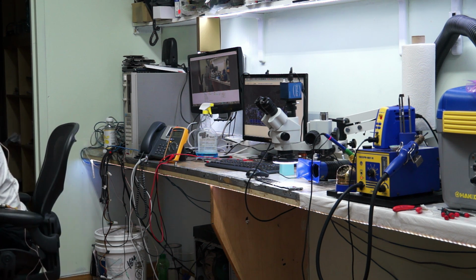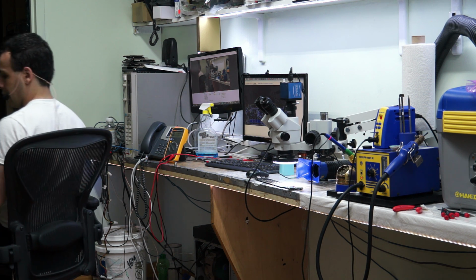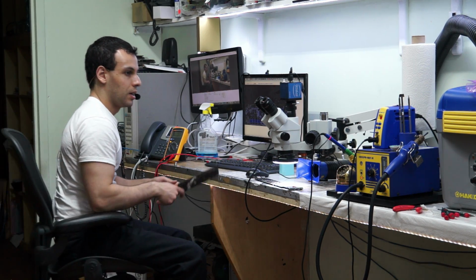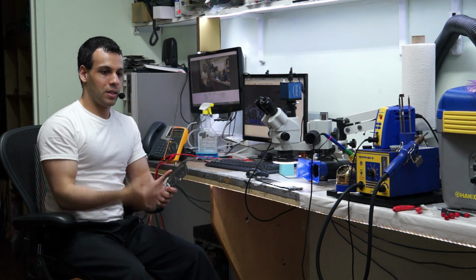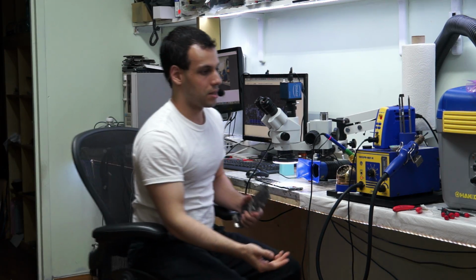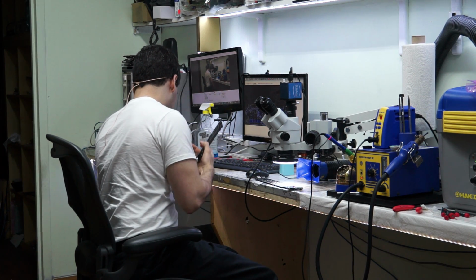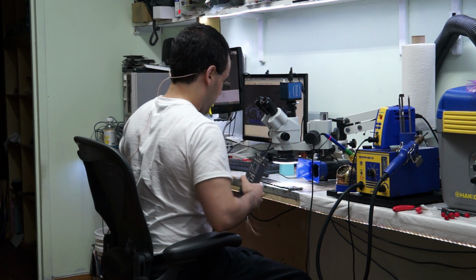Once I got to the point where I realized I'm spinning my wheels and I have a circular problem: I don't have 3.3, PCH is not producing the PM sleep signal from my S4 rails. My S4, I need the sleep signal from the PCH. PCH needs the BIOS to work. BIOS doesn't work because it's missing 3 volts. Missing 3 volts because the PCH is not putting out a SUS enable signal. It's this circular shit. I realized at that point that I should take a step back and start over because I may have made a mistake. And I did make a mistake.